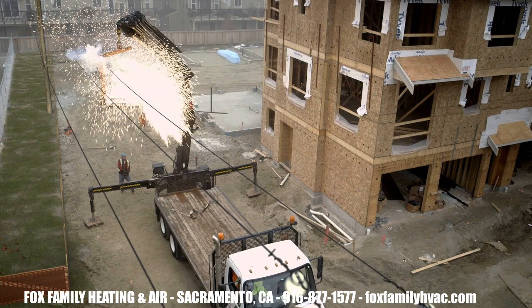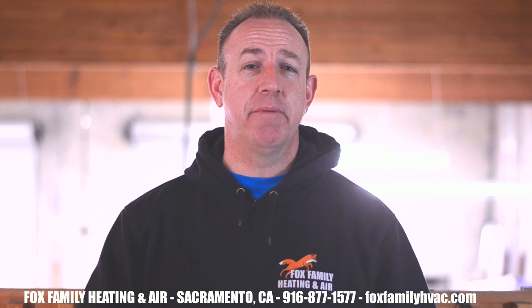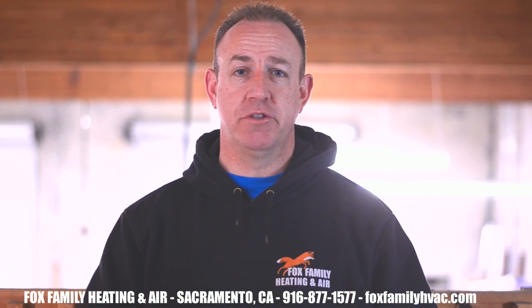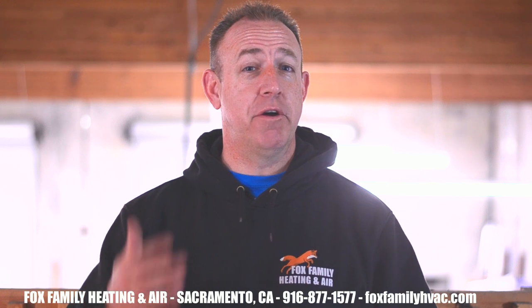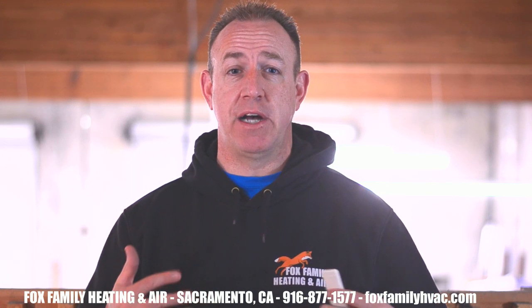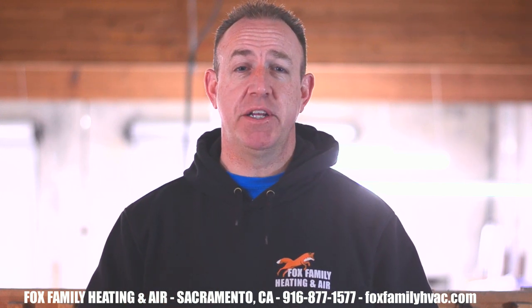Crane lifts on past jobs I've had have been so close to the power lines that you can even see arcing from the line to the boom of the crane. Nobody gets hurt, but it's important to observe general common sense and not go over and touch the crane or be near it. The crane company that we use is super professional — we've worked together on crane lifts hundreds of times. They do their part, but they aren't necessarily responsible for the job site safety of everyone working around the crane. That's where working together, respectively, plays a big part.